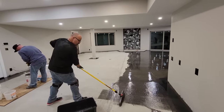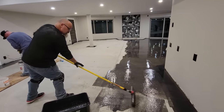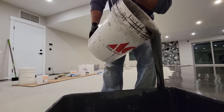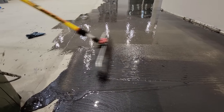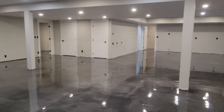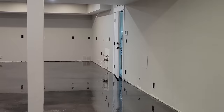Don't put it on too thick. If the seal coat is applied thin enough, the air can escape and it won't get trapped, therefore you won't have a bunch of bubbles to sand out the next day. Having multiple people help me allowed us to apply and mix all at the same time, so we were never waiting on more material. Mixing is half the battle. Let's finish the seal coat and we'll wrap it up for the evening.